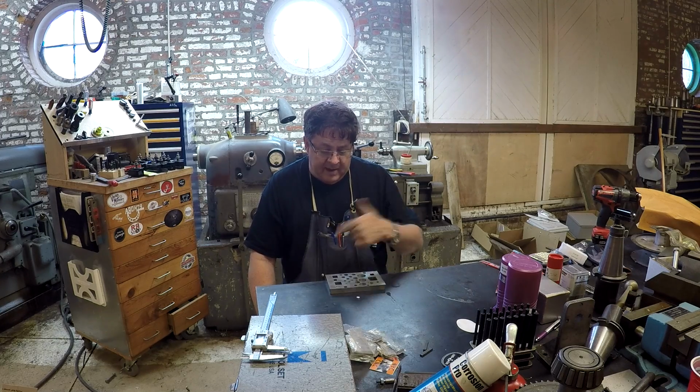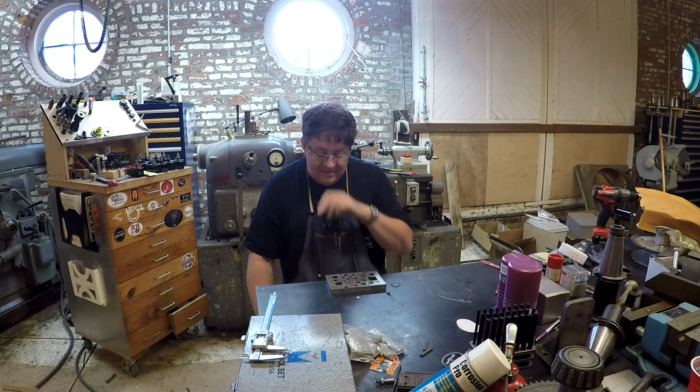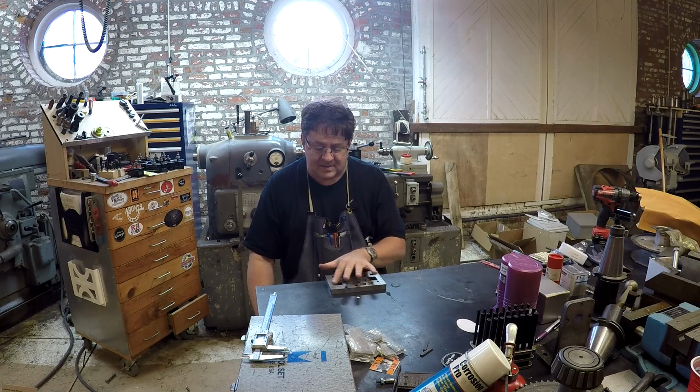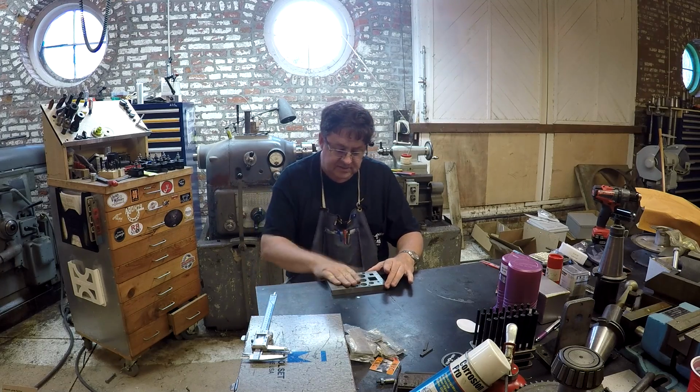So I'm going to bring the camera around so you can get a little better look at the construction. It's very obvious from the feel that this was all made, the ends were bolted on, and then the whole plate was surface ground on both sides, because you cannot tell where the surface of the block and the surface of this end cover, I guess you would call it, leave off. So I'm going to bring the camera over here so you can see this.